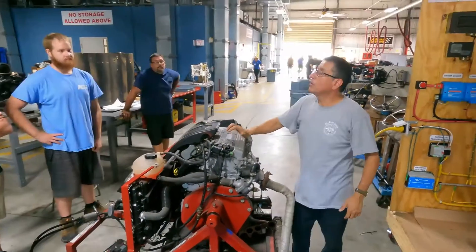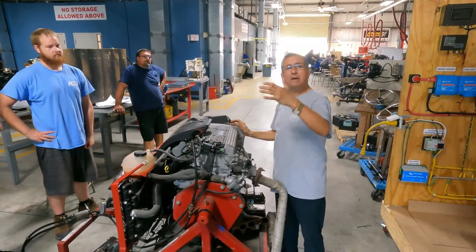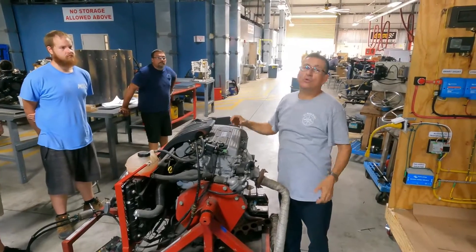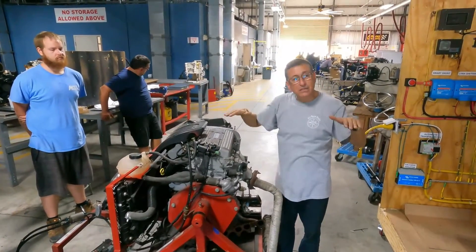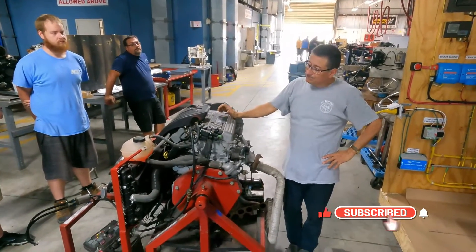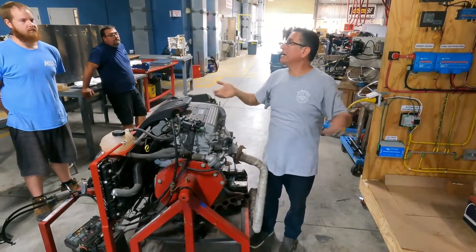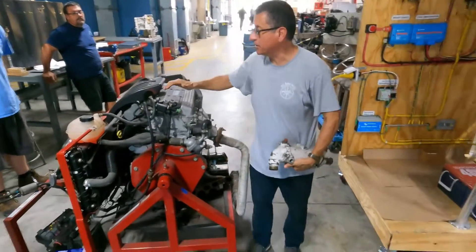Can I install this cooling application exactly as-is in my inboard boat with a closed engine room? No — you don't have enough air circulation to keep the radiator at low temperature. This is why: the radiator is good, but inside the engine room it's not good because there is no air circulation. How did the marine engineers solve that situation?